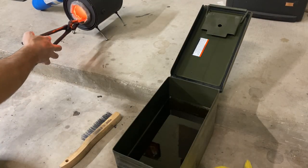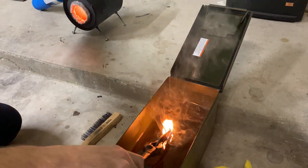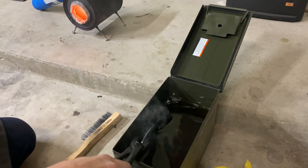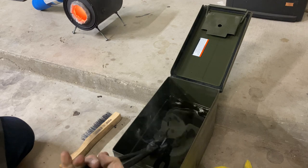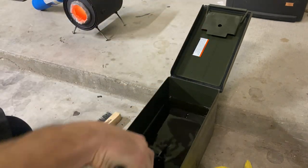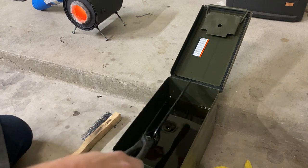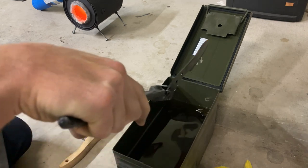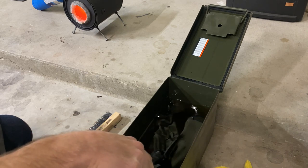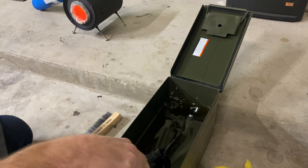This is at the perfect temperature, so let's get it into the oil. I'm moving it back and forth in here. Ideally I want to get this cool enough that I can touch it — it just takes a little bit of time but keep moving it around. One thing I forgot to mention: before you put the blade into the forge, clean it really well with dish soap and hot water. That helps prevent as much scaling and oxidation on the blade itself.